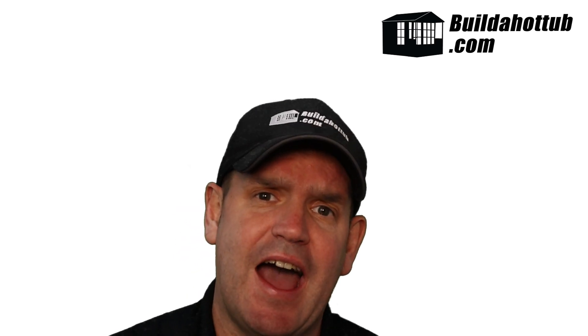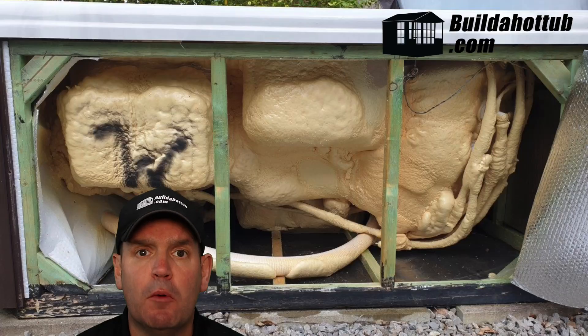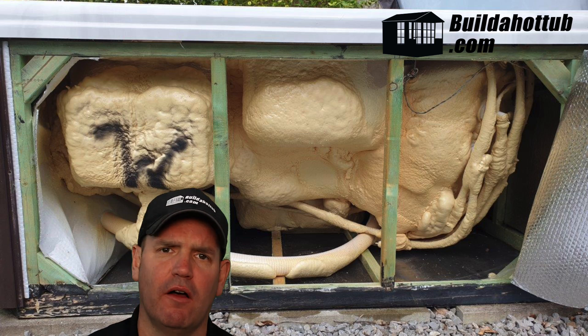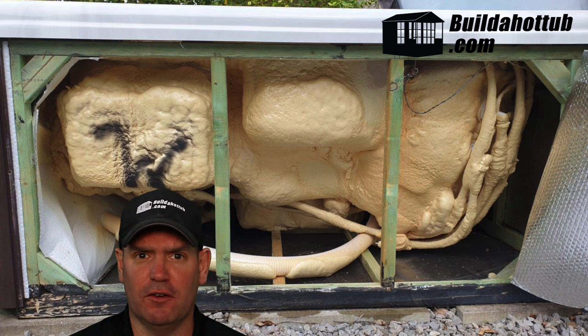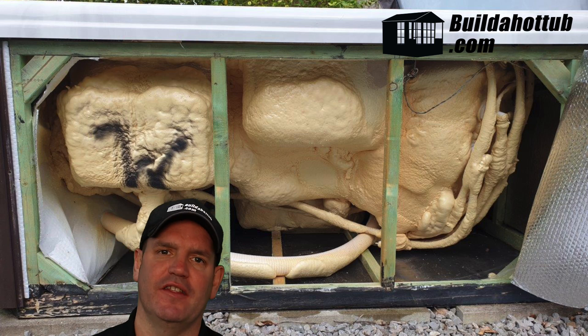Chris's hot tub is only seven years old, but he had a bunch of leaks that he needed to fix. As always with leaks, it's best practice to cut the leaking part out and replace it — don't try and stuff it with putty or anything like that. If it's leaking, it's a bad joint. Just cut the part out, replace it and glue in a new one. He also had to repair some rotten woodwork, which was easy enough to do. He also wanted to add some additional insulation. You can see how it shipped from the factory — there's quite a lot of space in there, and air conducts heat away from the water pretty well, so you want to fill that with as much insulation as you can.